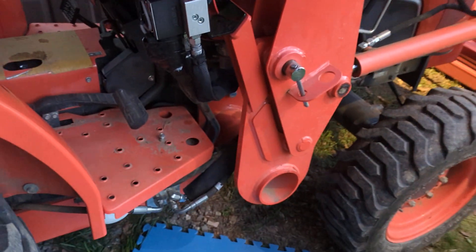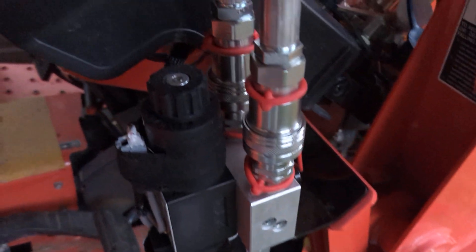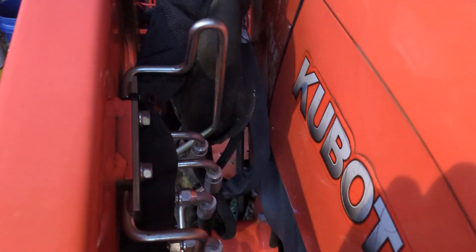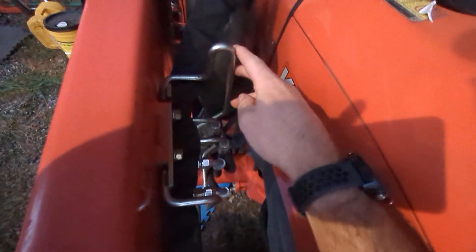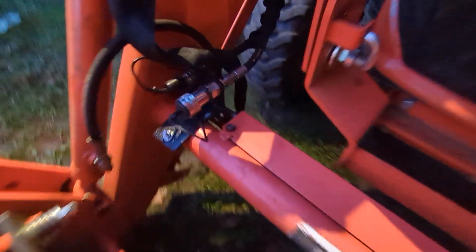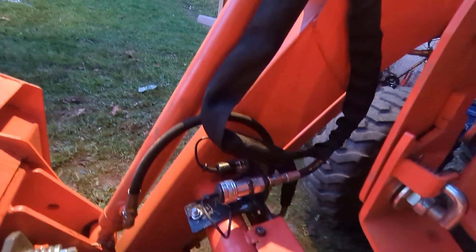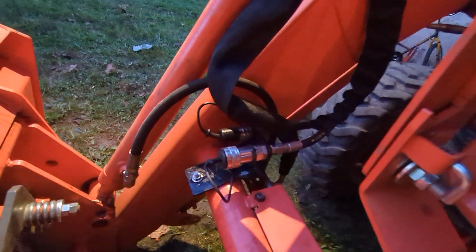It's pretty straightforward. In terms of the rest of the plumbing, it's really easy. You're going to have your two big quick disconnects up top. If you want to see specifically how I routed mine, I threaded them through the two hard points I already had, zip-tied them there, brought them all the way along, zip-tied them at another point, and threaded them through. I also took the opportunity to put a piece of hose guard on the one already there. And there are your two quick disconnects up front for whatever implement you want to put on.